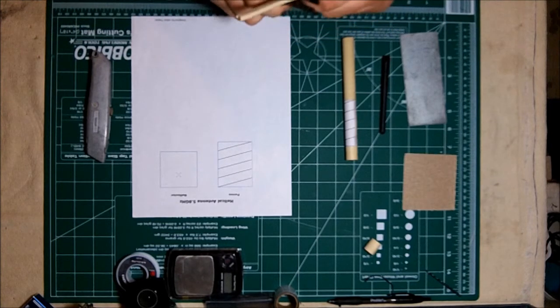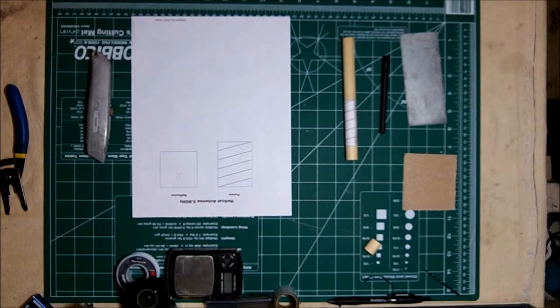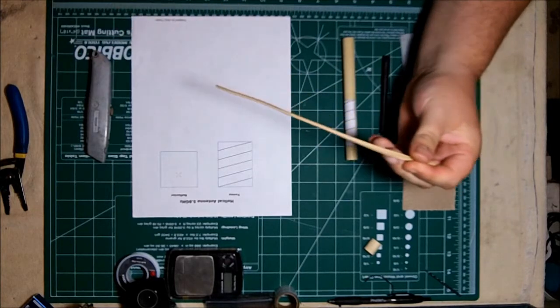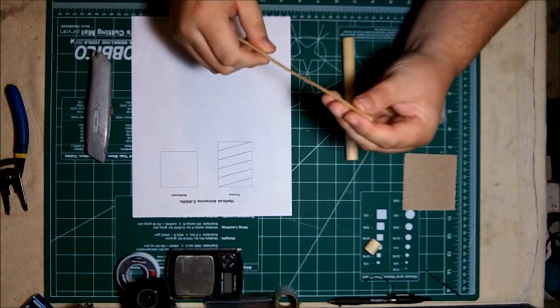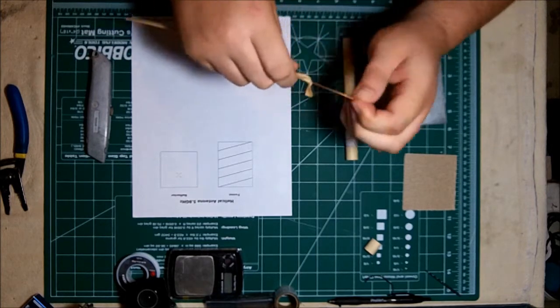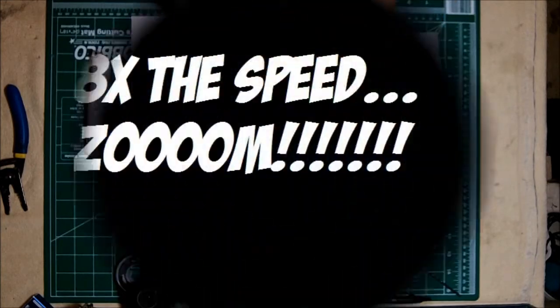So to get started, let's go ahead and strip this 14 gauge wire. Using some wire snips, I'm just basically scoring the sheathing on the wire, just enough to where when I give it a good tug, it exposes the 3 wires on the inside. We're going to take this center wire that's protected with paper because it's a bare ground. I don't have to strip any more plastic. The other 2 wires can definitely be used, but it takes a little bit more time to actually strip the plastic coating off. With this, I just pull the paper off, and I have a bare wire.